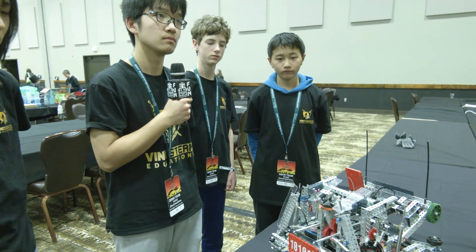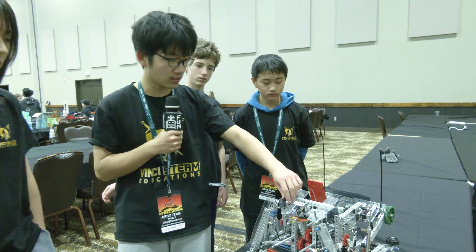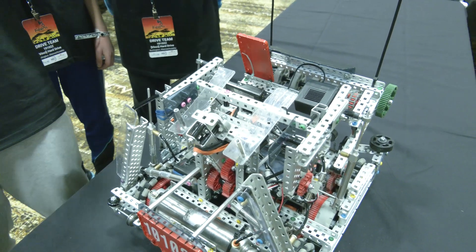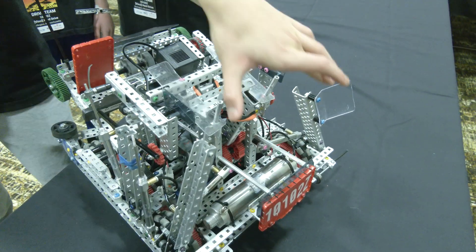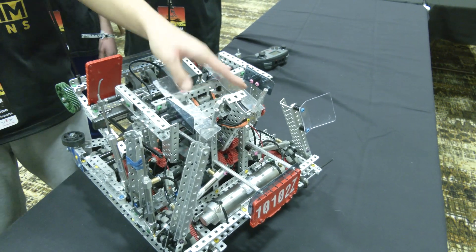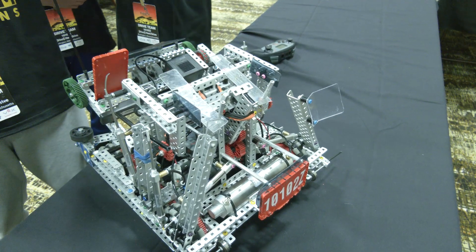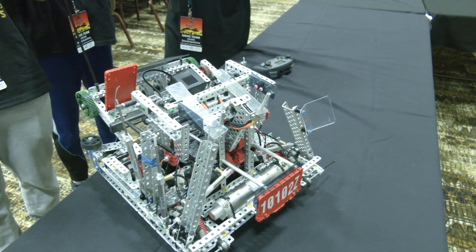The benefit of changing to this design is we could use these plastic shields to actively adjust the tri-ball. Before with the other catapult, our match loads had to go all the way over the robot and this part was open, so it was very hard to adjust the tri-ball — it was flying everywhere and that was not good. Now we added these plastic flats and also these standoffs — which are creative because they're connected to the passive hang — so every tri-ball goes to the same position, same height, same distance. That has been really great, especially for skills.